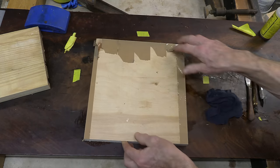These are the original nails. I thought the fact that they're cut nails didn't reveal anything about the age. But then I noticed the heads. The heads of the nails appeared to have been made with a hammer, which in the early days of cut nails, they still had to put heads on each nail.